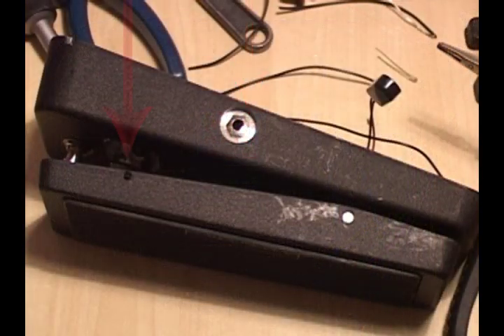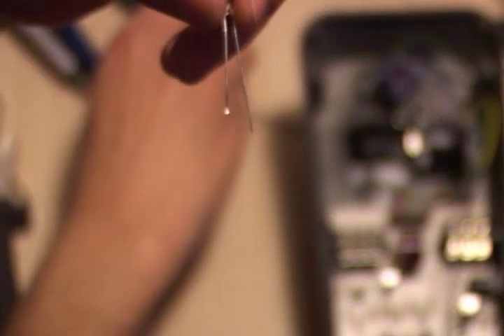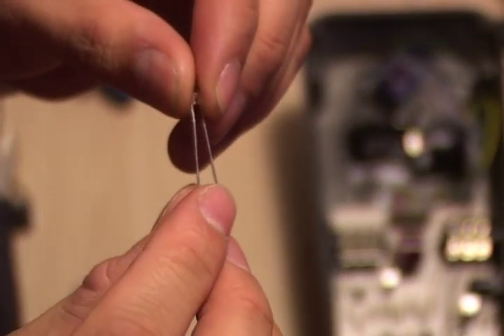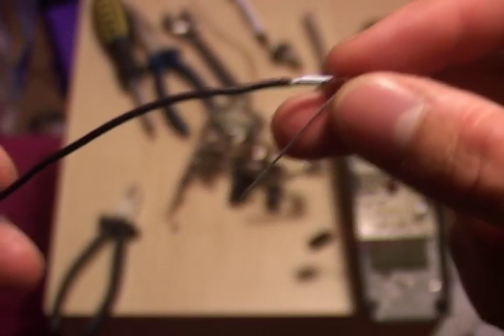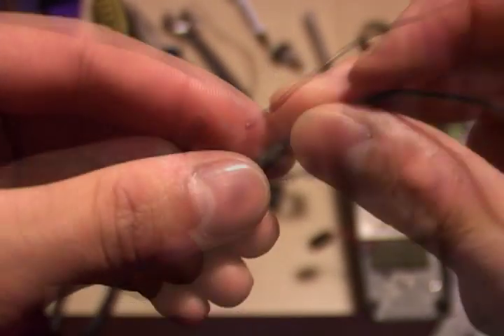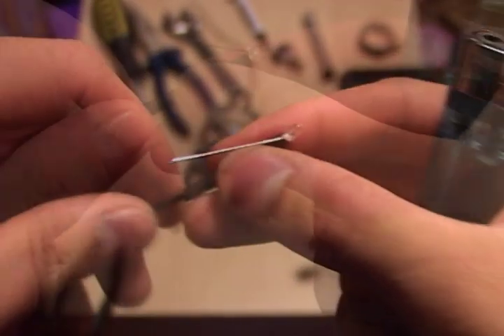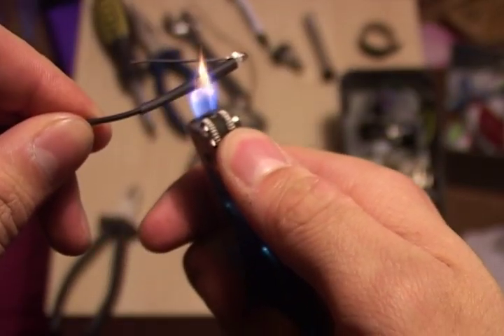If you notice, there is a pre-drilled hole on the side of the pedal on the left, and our LED fits perfectly into this hole. Now what we are going to do is solder on a small piece of wire to the short leg or cathode of the LED. You should then have something that looks like this. You will now have to cut two bits of heat shrink to go over the wire, then slide both bits of heat shrink over the wire before you solder on the other end to the switch. And then use a lighter to heat up the heat shrink around where the exposed metal is.